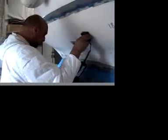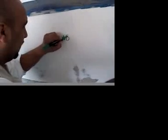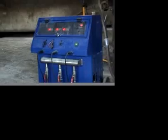Treating osmosis is an expensive process. The gel coat is stripped away and the substrate measured for moisture. This reading should be 5. Hot vacuum pads are attached to the hull and suck out the moisture until the hull is dry enough for a completely new outer layer. It takes a lot of time and expertise and can cost thousands.